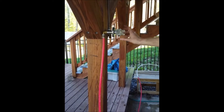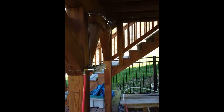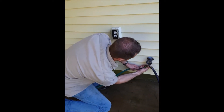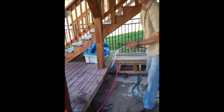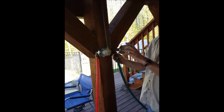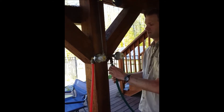You can see the air coming through the line. So that should be good — all set for hot water. For cold water, I just hook it up to my garden hose. I've got a shutoff on the line right here. One end goes to the faucet on the house, and the other side of the hose has an adapter that goes from tapered pipe over to garden hose style. That's my cold water. You just turn on as much hot and cold water as you need to get the right temperature coming out.